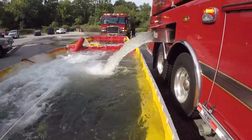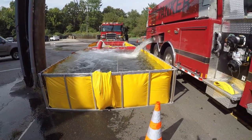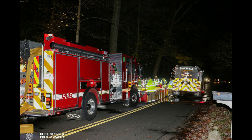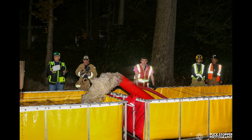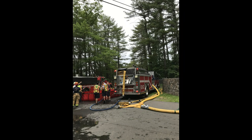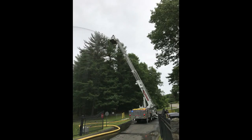With the proper level tanker response, our drills have successfully managed up to three portable tanks of 7,500 gallons of water with uninterrupted flows to a fire scene. At our most recent drill, we flowed without interruption 57,295 gallons of water over 94 minutes, with the tanker shuttle as the heart of the operation — averaging 610 gallons per minute to a fire scene, with max flows at almost 800 gallons per minute at times. We've even achieved a max flow of 1,500 gallons per minute with an elevated platform operating a 2-inch tip at 1,000 gallons per minute simultaneously with a blitz fire in operation at 500 gallons per minute.